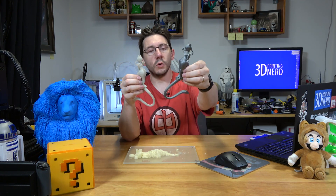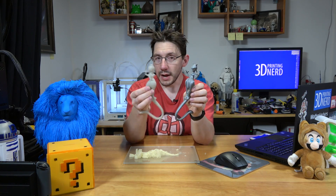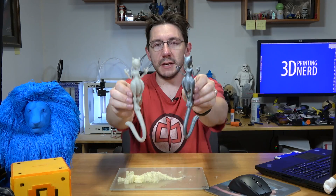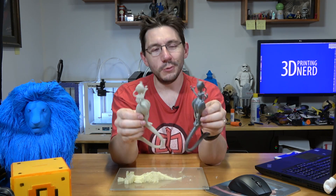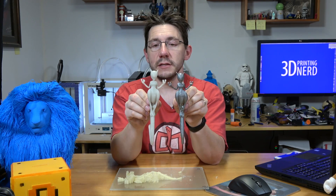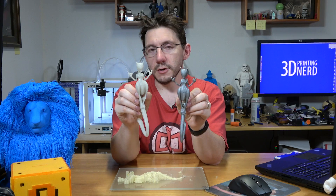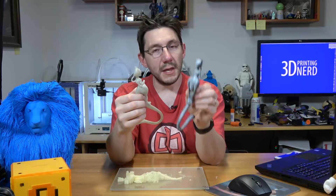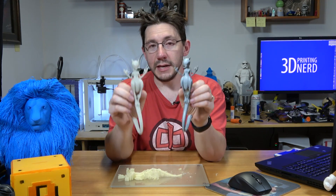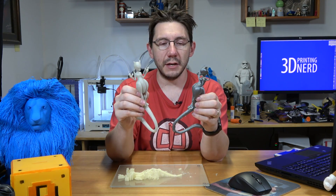The ColorFila still looks cool in silver; there's a little bit of PVA still to remove. The Matterhackers PVA I love because it's so easy to remove and provides great support. I thought this was an interesting comparison — two very capable dual extruder machines given quite a curve ball with this incredibly organic geometry. They both did a decent job. The model looks better from the Ultimaker, but I was much more impressed with the Matterhackers PVA. PVA is cool because you can print organic shapes on an FDM machine without worrying about digging support out and scarring the model.